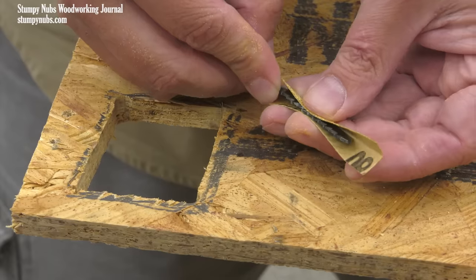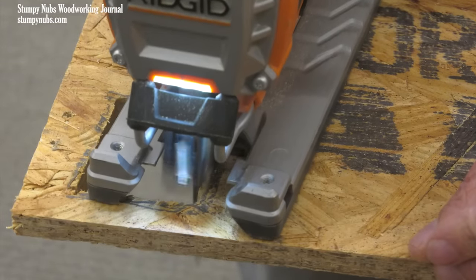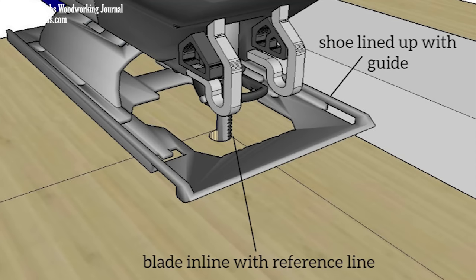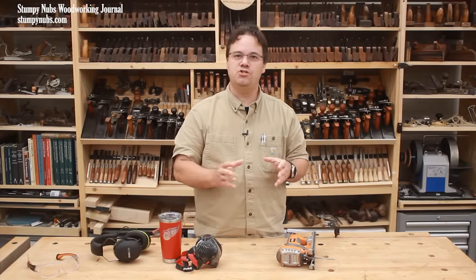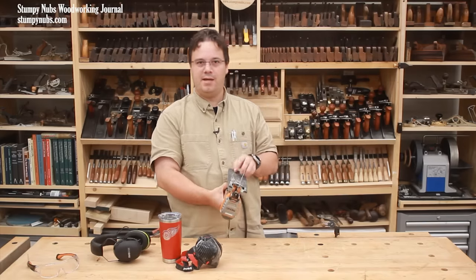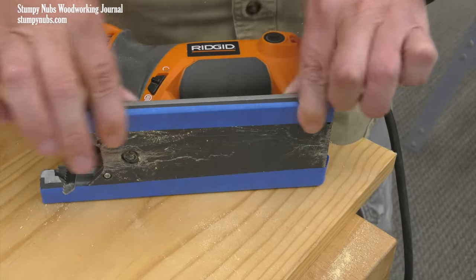Another clever way to use a jigsaw is to attach a piece of adhesive-backed sandpaper to the blade. Turn the saw on with the speed all the way down and you can use it as a power file to fine-tune an edge — just don't use too much pressure or speed because excess heat will ruin your sandpaper. Don't forget that your jigsaw can also be used with a fence to make straight cuts; some saws have attachable rip fences like circular saws. Wax helps the saw move smoothly for both curved and straight cuts. If the shoe might scratch a delicate surface, place strips of painter's tape on the edges of the base to create non-marring skis.